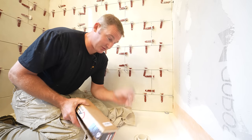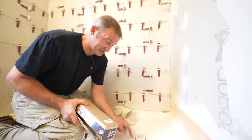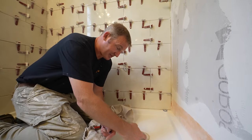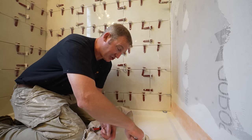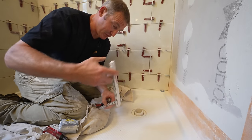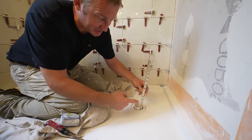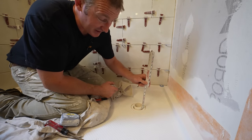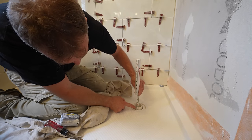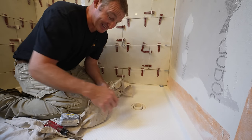In order to cut the pipe down — as you can see it's hanging up outside of my shower pan — we need to cut this down. You want the pipe one inch into the fitting. Measure down to the bottom of your fitting; this is a two-inch fitting, so you want it one inch up into the ODI fitting. We've got two and a half inches above the pipe, so we need to cut this pipe down an inch and a half.